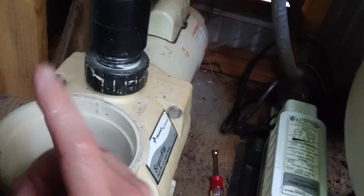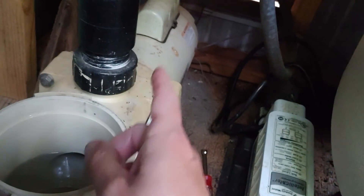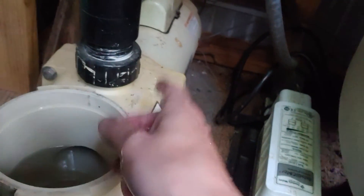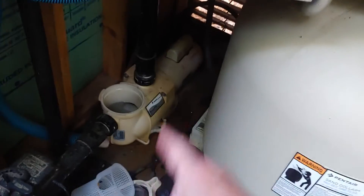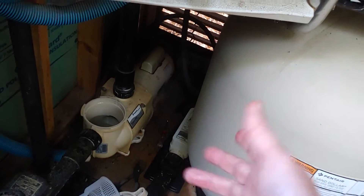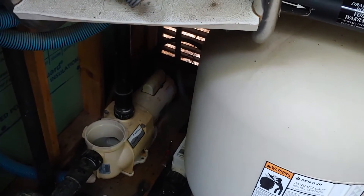What happens is sometimes the motor reaches a flat spot, or it binds up in the winter with a little bit of crud on your brushes. You basically just fixed it — there's nothing else to do. A way to avoid that is every month during the winter, turn on the power to your pump for just a little bit to keep it free.